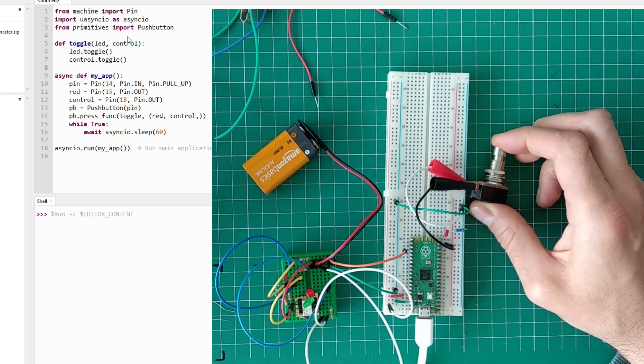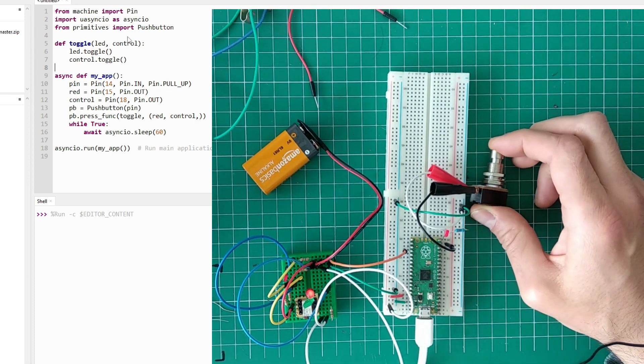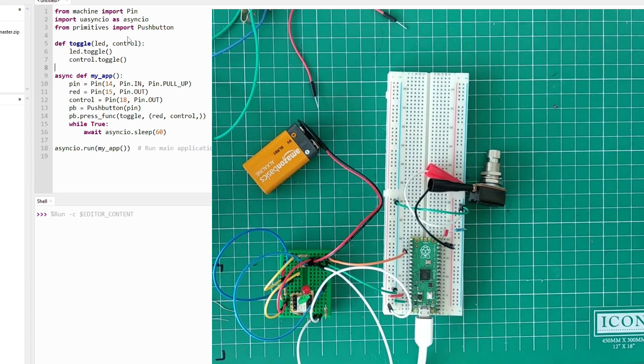Let me run this - and it works, and it was that simple. I'm toggling the relay and you can see the red and green LEDs switching. The green one is a bit dim because the forward voltage of green is higher than red, so I could have scaled those resistors a bit, but this was super simple.